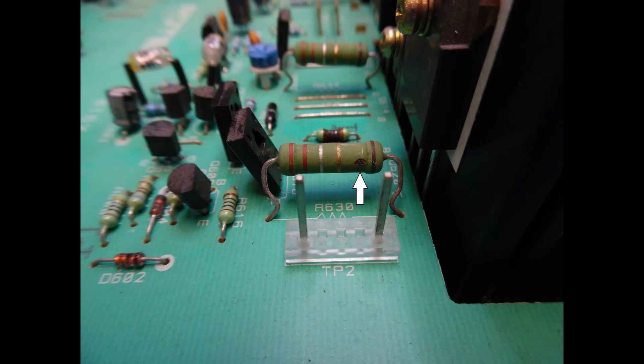It's a case of replacing the two power output transistors, checking the driver transistors and associated transistors in the earlier part of the circuit, and most importantly doing resistance checks to make sure none of the emitter resistors are open. The other emitter resistor was high, not open circuit, but as a matter of course — these are 2-watt resistors — I replaced them all, including in the other channel as well, since they've been in operation for a number of years.